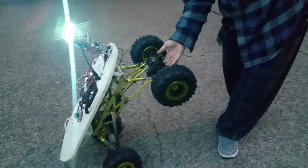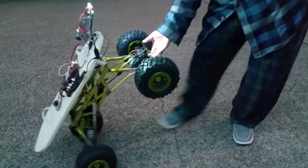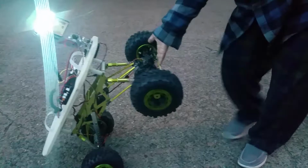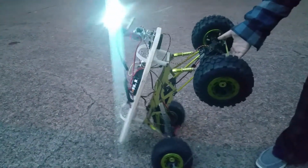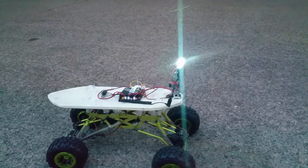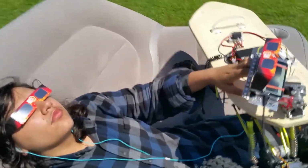But we are having trouble getting our PID values correct. It may be that there is too much lag between sensor updates and the motor reactions, but we haven't tested it enough to say for sure. We've heard the next release of the REV firmware should have more input-output improvements and improved responsiveness.